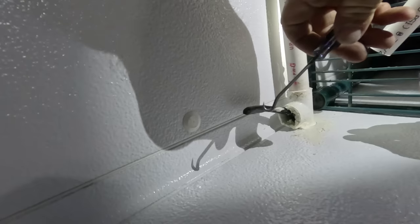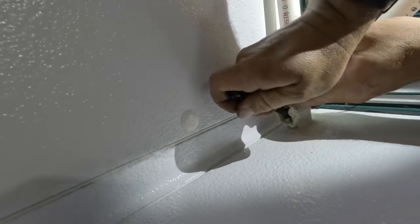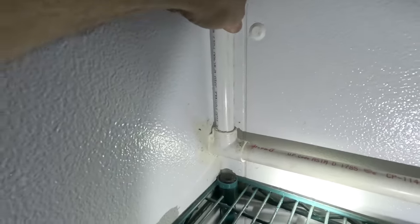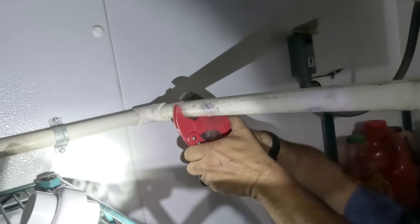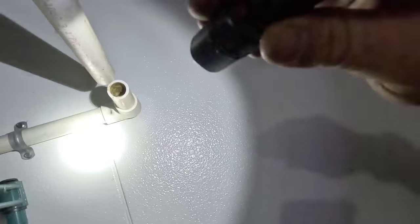I'm going to hook it and pour it in that way so it doesn't spill over the edge. There it is — it's leaking down there. See, just what little water I poured in there, it's already leaking. Probably got a buildup of crap in there — that's what sucks when they do it like this. They went ahead and screwed that on there — that's not going to be very good. I was able to pound that down in it. I did not glue it. I got a union right there. You can see the drain line looks about half nasty and plugged up. It really probably needs to come down — and even a new drain line.